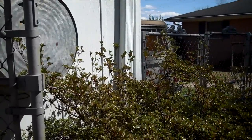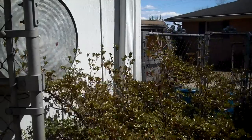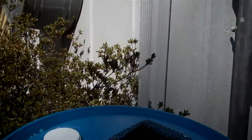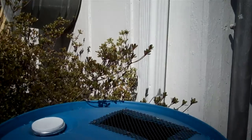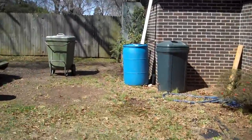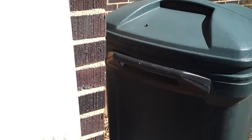You want to come over to your gutter. You want to take it and just cut it right off, right flush with your barrel there. And then you just lead your end right in there like this. And what you end up with is something like this — just feeds right in there. Keeps big debris such as leaves and garbage out of the way.